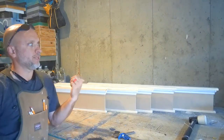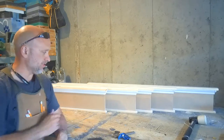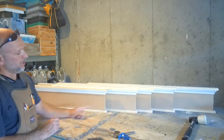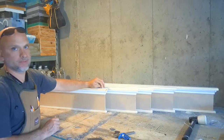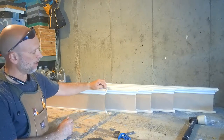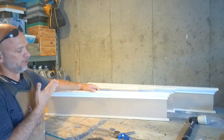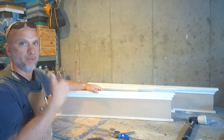It's a pretty easy project — made five headers. It's a good example of batch carpentry. Once you've got all the components cut, assembling them is pretty easy. As a recap: we have a half-inch MDF base — this one was 39 inches wide, six and a half inches tall — then an inch and a half of pine shiplap on top, about an inch and an eighth on the bottom. I let it overhang about a half inch on the bottom and about an inch and an eighth on the top, just to support the poplar molding. You can caulk and fill this in the shop, or when you're doing the priming and paint.